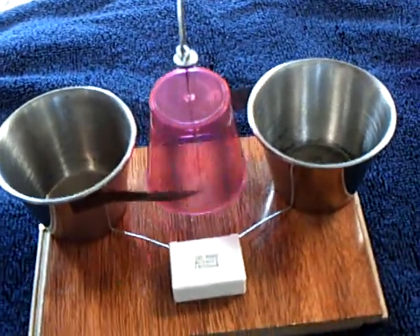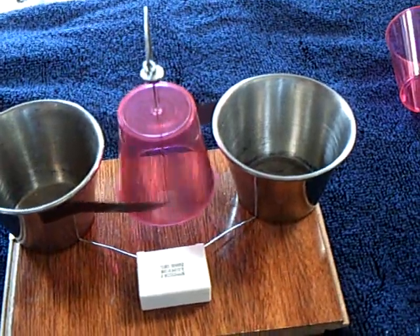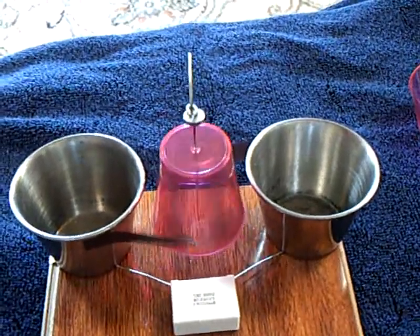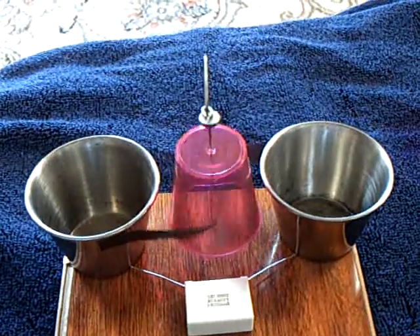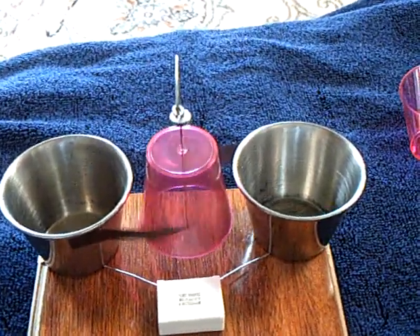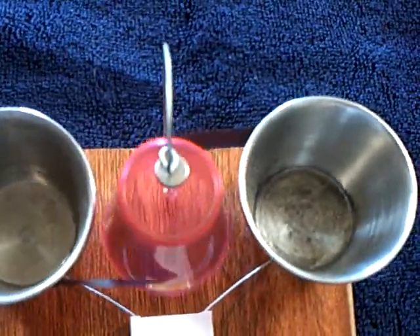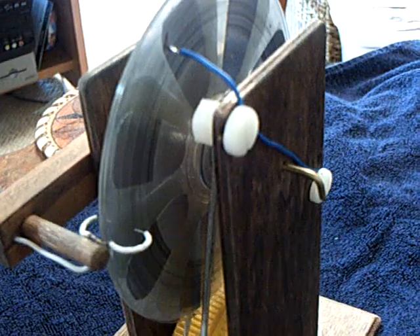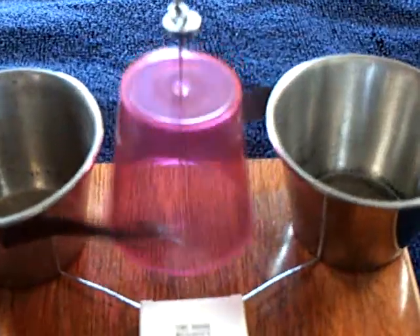I was really happy to see that it works. It makes building these electrostatic devices simpler than having to use aluminum foil tape — all you've got to do is rough up a surface, put graphite powder into the little scratch marks, and you've got a segment. For the brushes, it's just scotch tape with the graphite on the sticky side. It worked really, really well. The application for a Wimshurst machine is really good — it gets you away from the friction and the tearing up of the rotor with the brushes.